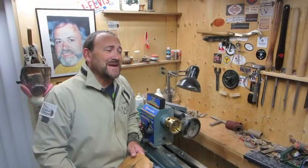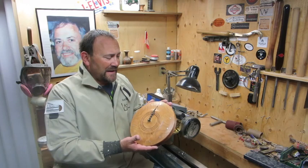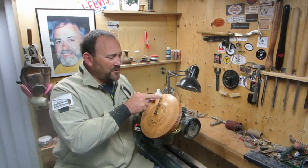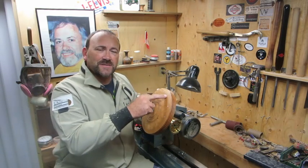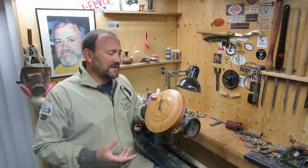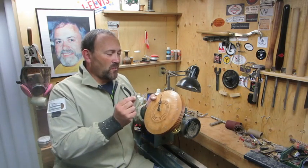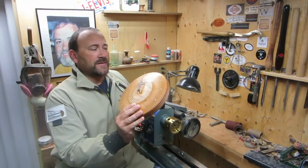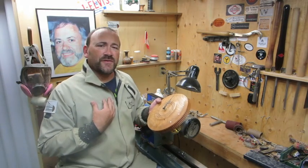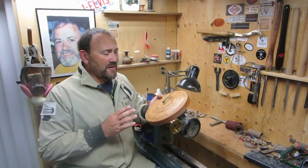And thanks for watching. That was a project that I did for Lee Valley. I'm going to be teaching a course in October, and I'll be making something like this. I think next time, I have learned the aluminum is a nice effect, but it does tend to streak some oxidization a little bit, so there is a little bit of a streak mark there. I'm thinking what I could do is quite easily remount this to the lathe and put a bead over top of those aluminum wires where they are. I mean, it's not that big of a deal, but from my perspective, I would prefer that it didn't happen. I would like to see a cleaner finish, but overall I'm very happy with this project.